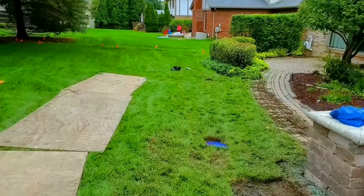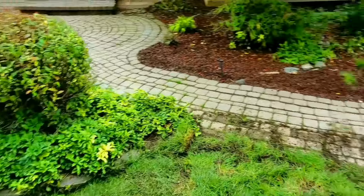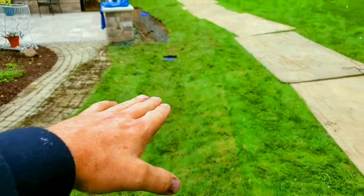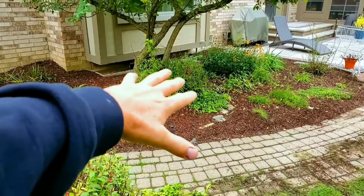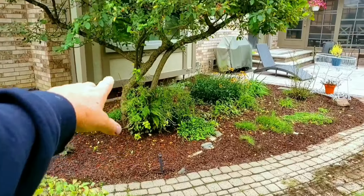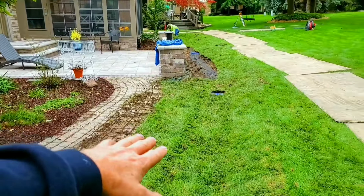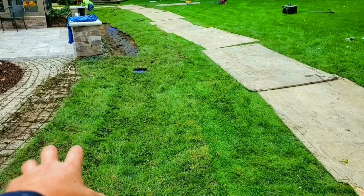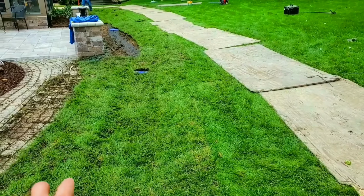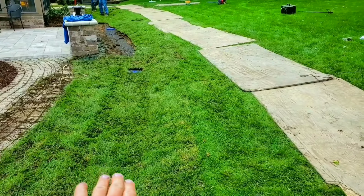Keep in mind, if you're going to use this technique, the amount of area you're going to need. So normally, if this wasn't just all built up and the water just ending up flooding the basement out, all this water would be standing underneath that cantilevered bay. When you're shaving down your French drain trench bank, two things. One, you can't build it over here like you normally would. You have to get out here because you're going to taper that bank. You need distance to taper this bank.